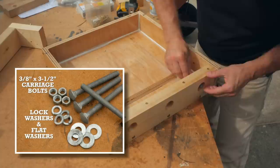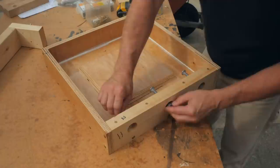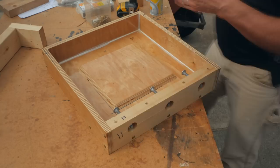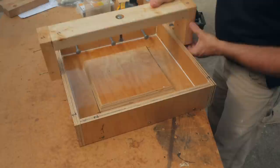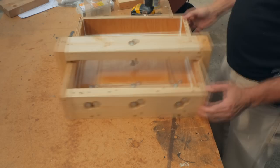Now I'll insert the three bolts. I line them up with the outside face of the bolt block — I don't want the ends to stick out past the outside edge, as this will make the bolts stick up on the bench seat. I add a nut to the ends of these bolts and snug it finger tight. The counterbore allows room for my fingers or a socket. As this is a prototype, I wasn't sure how well the bolt block would hold the bolts during assembly, pouring, and vibrating the form — the nut is just a bit of added insurance. Now I secure the bolt to the bridge with a washer and a nut, then set the bridge in place and screw the supports to the form walls. The form is now ready for concrete.